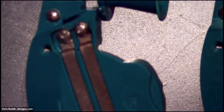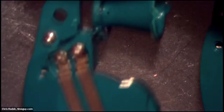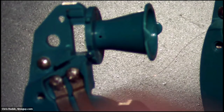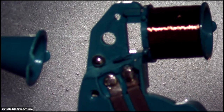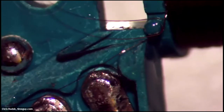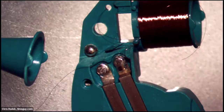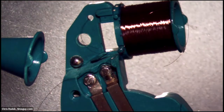I don't have one of those to show right now — I've been cheating and showing you customer watches. Here is a coil — this is a 214 coil with the wire stripped off and the protective coating stripped off, ready to go on my winding machine. And here's one that's got the wire on it, but it's not soldered yet. You might be able to see the ends of the wire that need to be soldered — actually you can see all four wires there. There are four because this one has two windings: one for sensing the position of the magnet and the other for driving it.